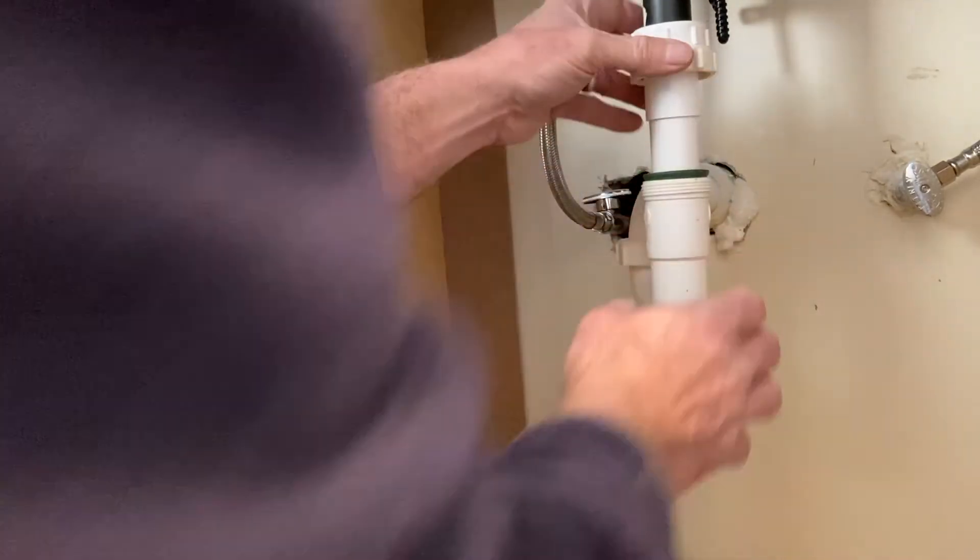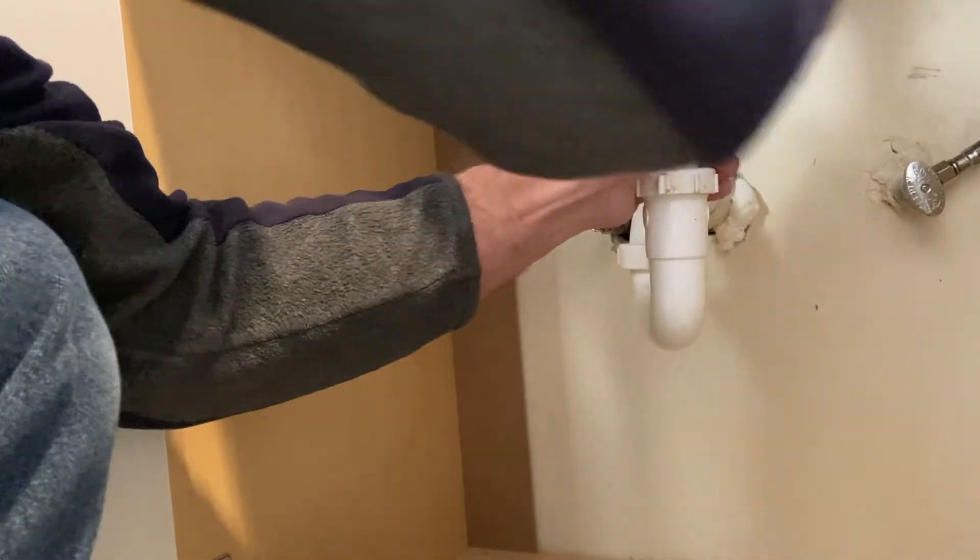All right, get on there, like so. We're going to put this back on. Getting this one started first and I usually get it pretty close, and then I slide this one down there. Make sure that washer isn't at a hard angle — a lot of times in plumbing this thing will be kinked, and that's no good. You want it pretty darn close, because if not it's going to dribble on you. Got that snugged up, that one's snugged up. Let's snug this one up.